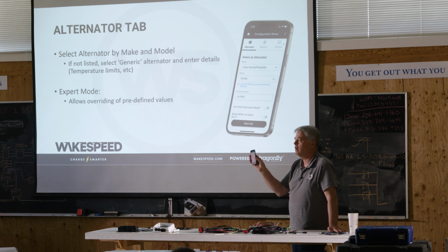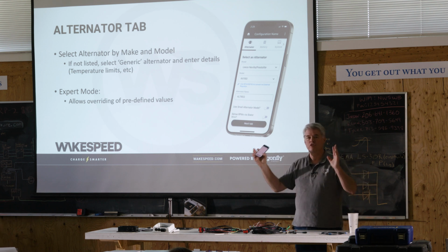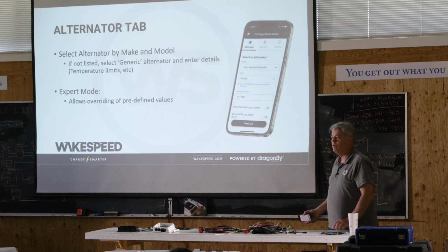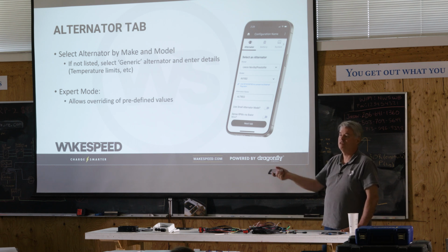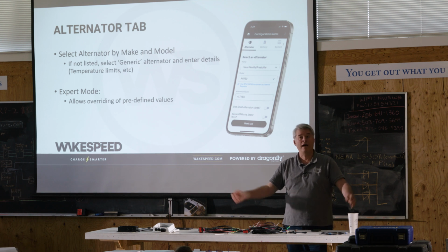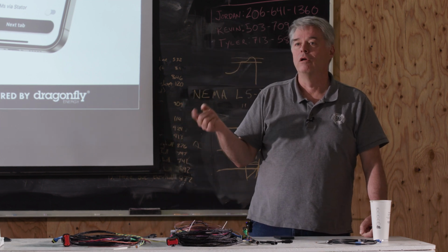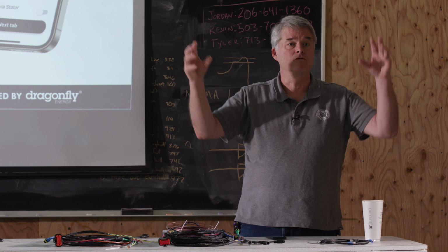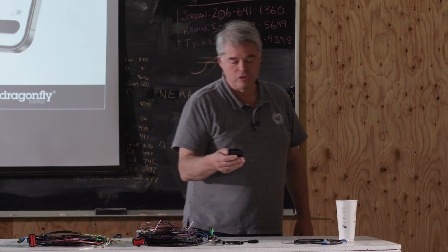Engine ID, this is another one of those instances. If you've got a port and a starboard, you're going to have to look at the instance ID to associate the regulator with each one. Go to the Bible. There is a difference between instances on RVC and NMEA 2000. One of them starts the numbers at 0, the other one starts the numbers at 1. So it's actually RVC, it's J1939. It's going to be 0 and 1 for J1939, and for NMEA 2000, it's going to be 1 and 2. You're entering numbers here, and it's documented in our manual as J1939 instances. But when you set up those NMEA 2000 gateways, you're going to set it up as 1 and 2.